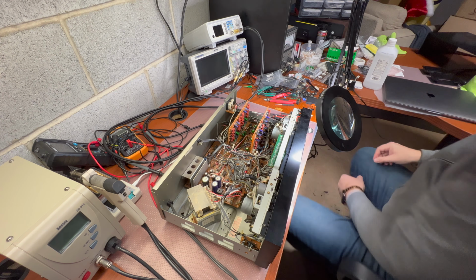And as you see, it has an auto stop sensor on the right reel. While we are rolling it, it will be working. As soon as we stop rolling, you see it changed direction. Okay, and here is the fast forward and rewind. A little bit noisy gears, but it's fine. Both directions work, everything works fine.